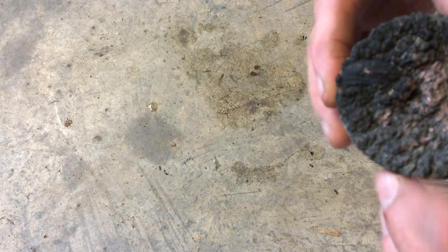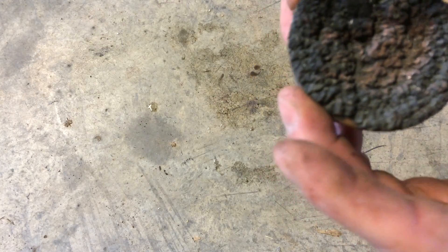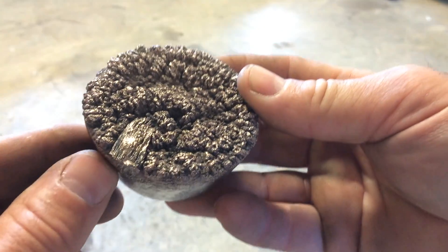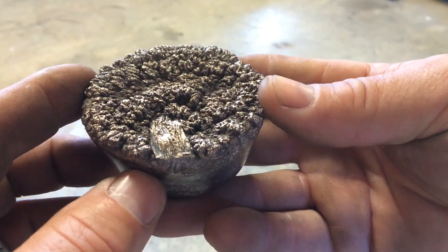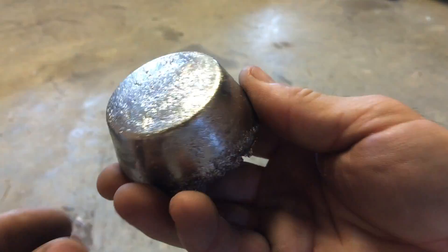So this is my dross — this is interesting. These little buttons that were on the faucet handles are fine; you can even still read them, so I guess those are ceramic and pretty heat resistant. The top looks like it's all dross but it's actually metal. I'm not sure why it poured like that, but the point is the furnace can do it. Maybe someone experienced with brass pours can tell me why that happened. I didn't degas it, I didn't use any flux or anything — so maybe that's why. But kind of cool. Furnace works.